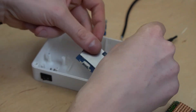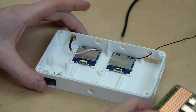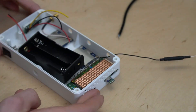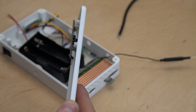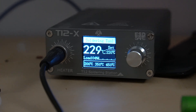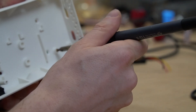The next thing I like to do is take all the components and dry fit them in the enclosure to make sure everything fits with no problems. Once everything fits nicely, set your soldering iron to a temperature about 10 degrees higher than the melting temperature of your filament, then use the tip to push the heat inserts inside.